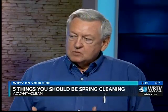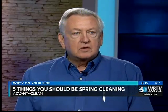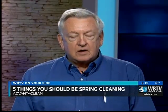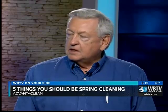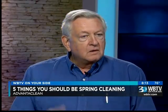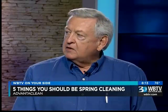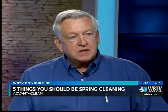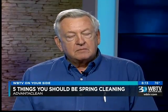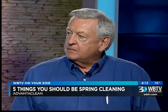Okay, we're talking about the outside of the house and how to prevent water and moisture going into your crawl space or basement. The key thing is to keep the water moving away from the foundation. So you want to make sure that you've cleaned your gutters. A lot of people do it in the fall after the leaves fall, but dirt and debris and leaves still get in there during the winter, and you want to make sure they're clean so the water's flowing properly. When the downspout comes down, a lot of them just end right above the ground. Well, that water just seeps into the area around the foundation, and you want to divert it away from the house, so all of the water flows away from the foundation.